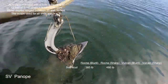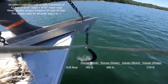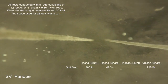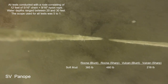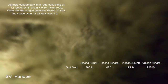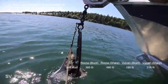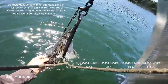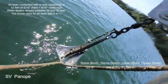Averaging those two pulls at 240 and 195, we get 218 pounds for the Vulcan in the sharp condition. For the Vulcan in the blunt condition, I found initially a hold of 195 pounds then a full release, followed by a reset and a perfect repeat of that first pull at 195 again. My theory is that the slightly less ability to penetrate meant it didn't pack quite as much seabed into the fluke, which allowed it to reset. But overall, probably not a big change for the blunt leading edge on the Vulcan in this seabed.